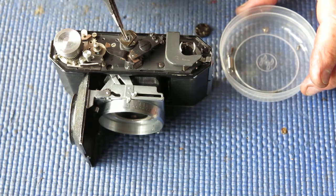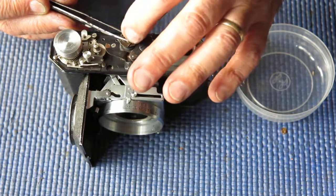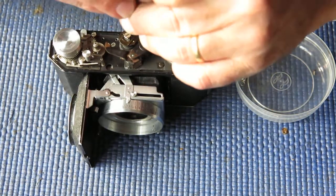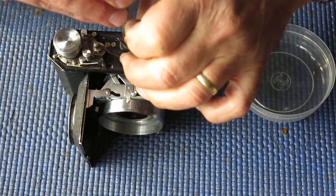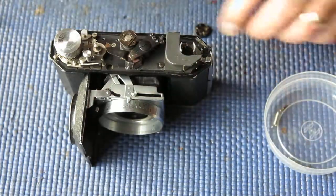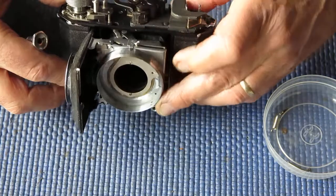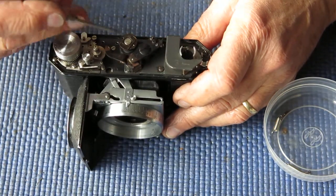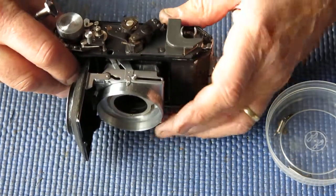On top of that we have our triangular washer, which is some sort of spring washer or lock washer. And then we have a single screw holding this together. Now effectively, that shaft coming up from the lever will be pulling into a taper. So as you do that screw up, it pulls up tight and then doesn't want to turn after that.